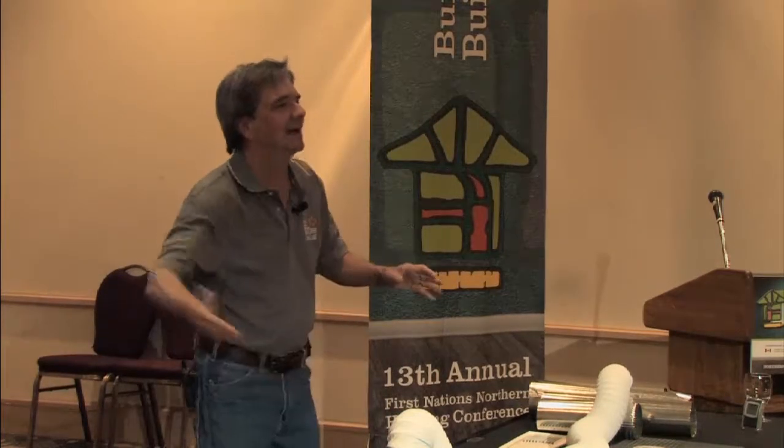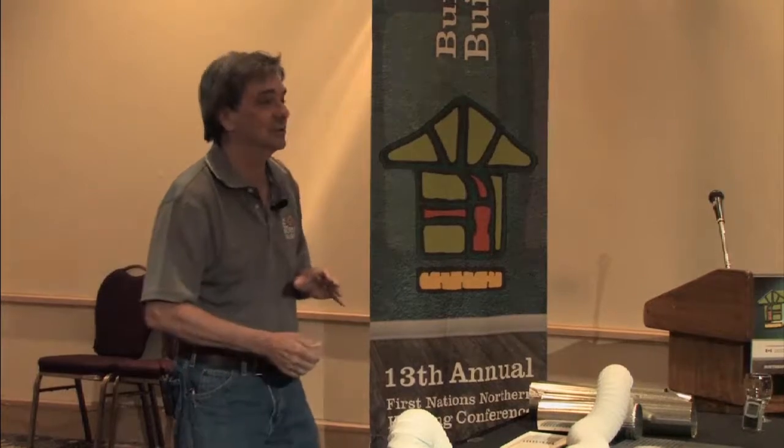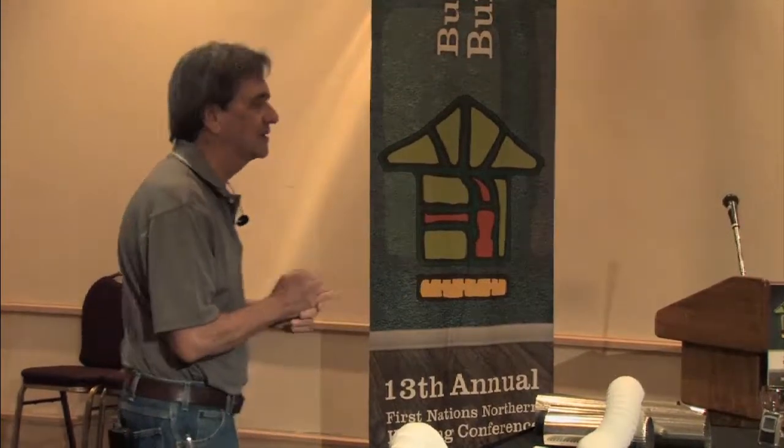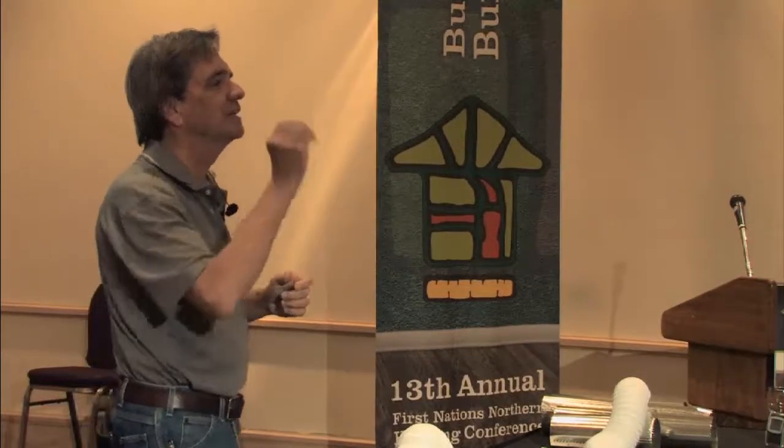Well, when you block off the door, that was the air path for the hot air into the room to get out. Which means that no hot air went into the room. No ventilation air went into the room because they blocked the door off. And in fact, in all the modern houses, we cut the doors about half an inch, 3/4 of an inch shorter than we used to let the air come through.